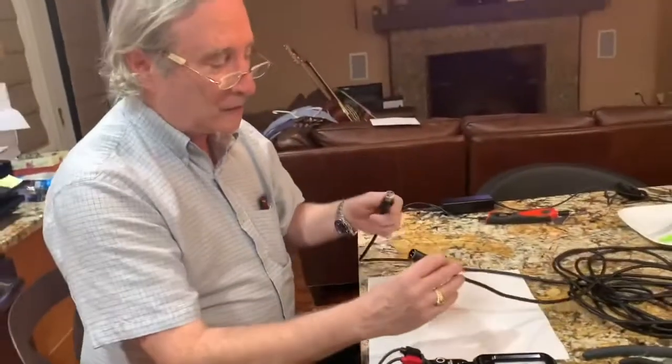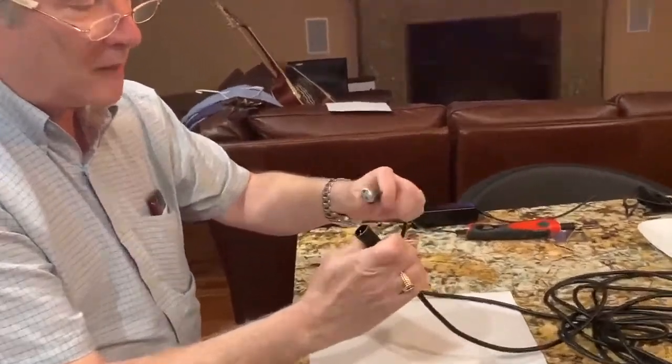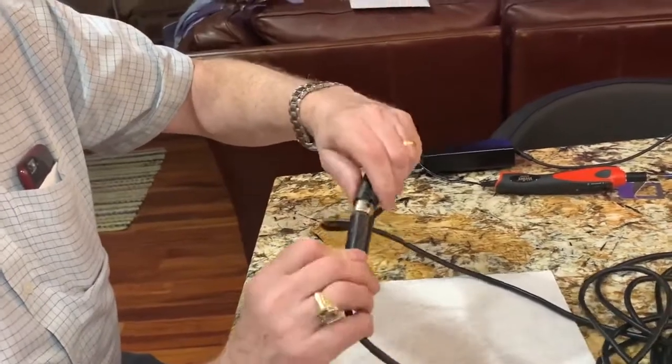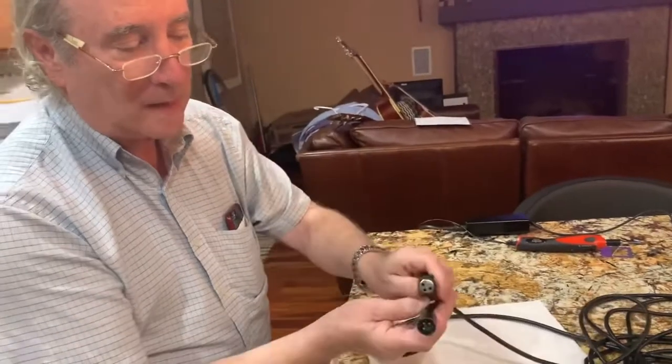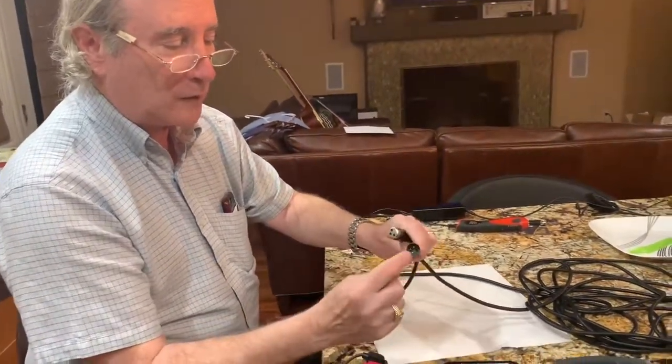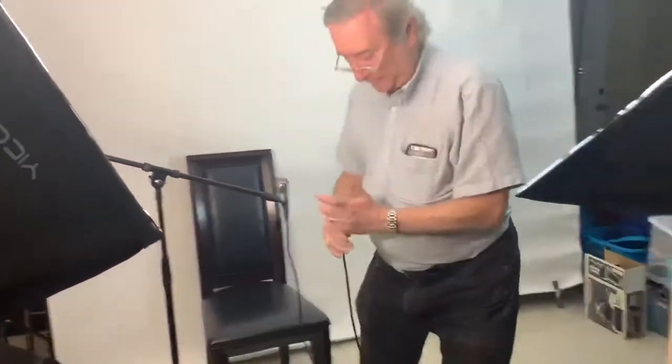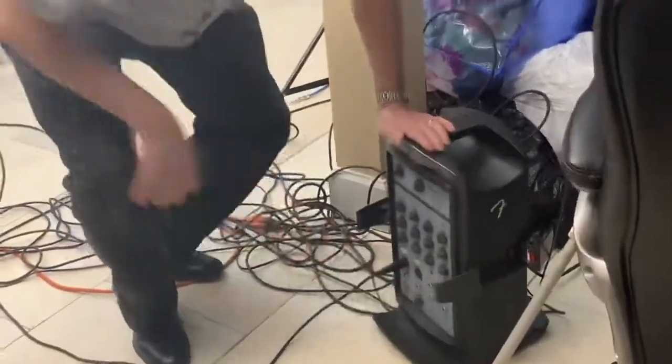We've repaired the cable. There are male pins on one end and female pins on the other, with a little plastic key so they only go together one way — you can just spin them until they catch. The microphone plugs into the male pins. Heading back downstairs for the final test: we plug in the mic, plug the cable into the amplifier — check one, two — yes, the microphone is working! Thank you for watching, please subscribe to the next Tribal Knowledge. Steve Matza, thank you.